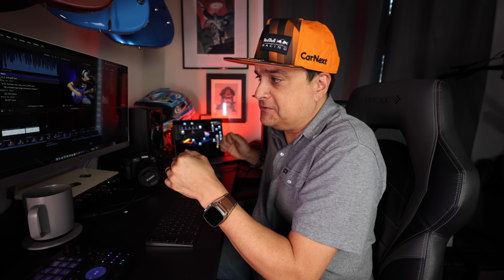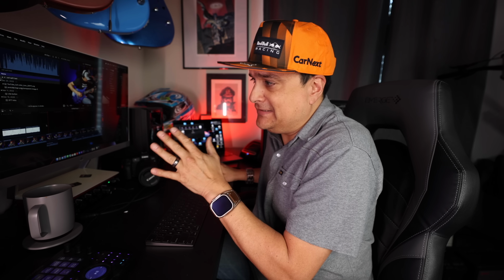Because you can listen to both pickups and you can be like, well, yeah, the sound does go away. But what it really is, when you look at the EQ and the dB meters, is a frequency change. If we look at the PRS stock pickups, we're getting about an 8 dB drop, which is a lot. On this clean tone in the clip you heard at the beginning of the video, when we pull the coil split, we're getting about an 8 dB drop.